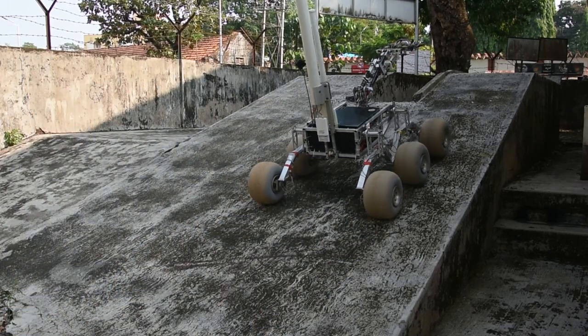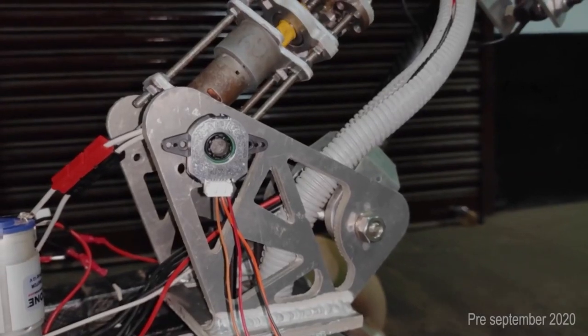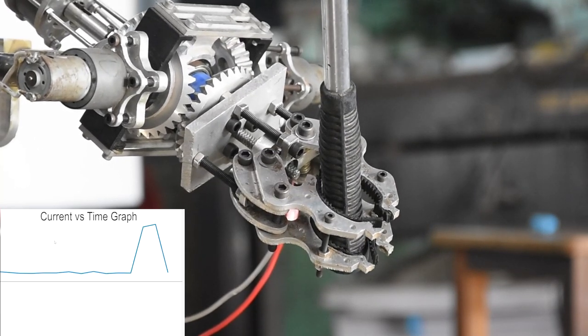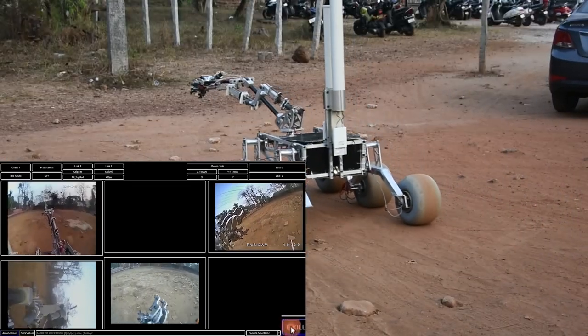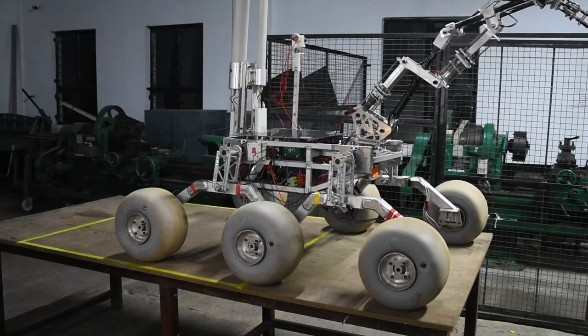The six-wheel skid steer is equipped with hill assist for ease of traversal over rugged terrains. Velocity kinematics is implemented using absolute encoders, and current sensors are used at both linear actuators and the gripper to perform tasks with more intuitive control and accuracy. Two levels of safety measures have been implemented: fail-safes in the code allow the rover to remotely cease all operations, and a kill switch has been provided for enabling emergency stop of the rover.